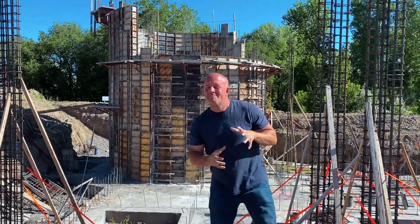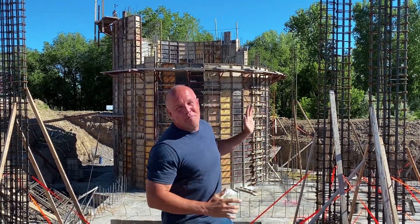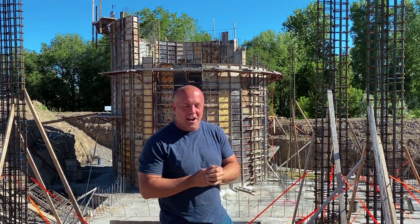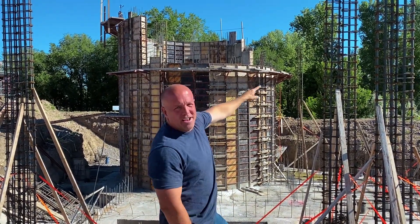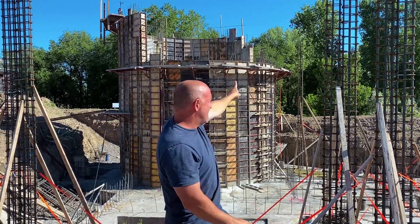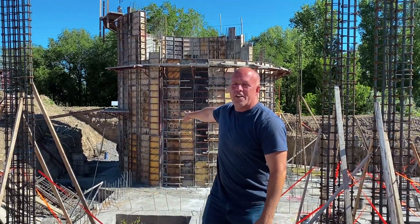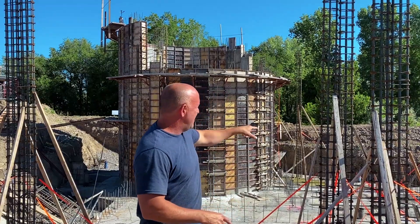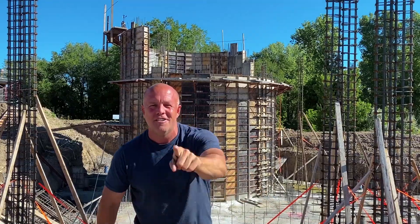Hey guys, I'm really excited because today we are stripping the forms off the deep end of the swimming pool. The pour went really well — it's a bit scary when you do that tall of a pour because the pressure at the bottom gets insane. We had a couple of pins starting to pop and bulge a tiny bit, got a bunch more kickers on it, stopped it, and finished the pour. I'm really happy we didn't have a big giant blowout. The back is 27 feet tall; this big cut-out in the front is where the pool goes 50 feet total in length. This is the shallow end of the pool that comes across this direction of the house. We've got a lot more to go — today we're going to start pouring the rest of the foundation on this end. I'm standing in front of two sets of garages — a 20-foot door here and a 20-foot door here — and these actually drive under the shallow end of the pool, so you'll see the pool above you.